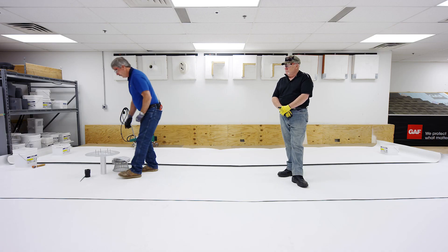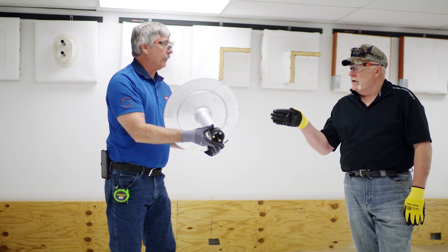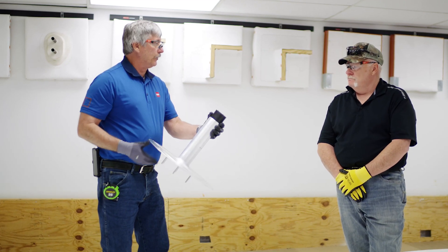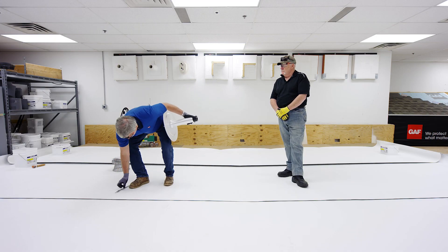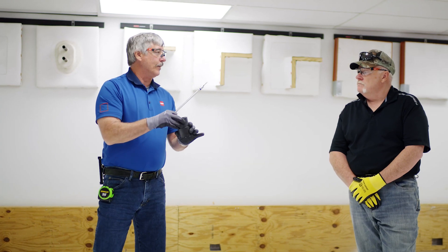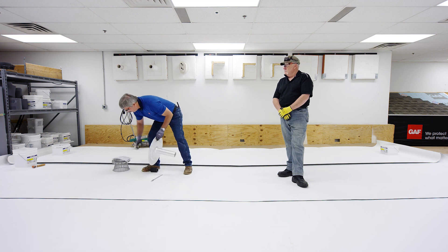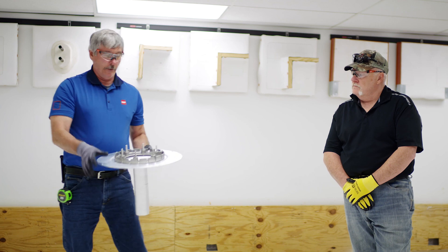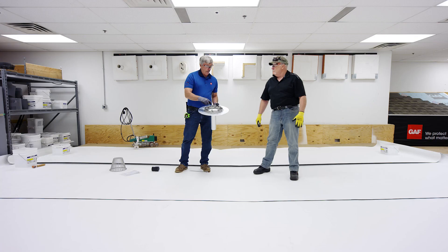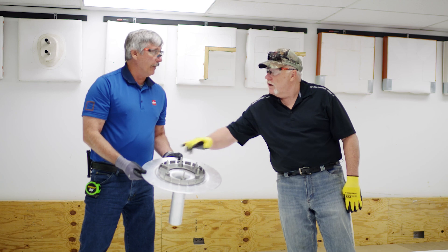Speaking of the drain, there's all kinds of them out there. This one is pretty simple to install and they come in different throat sizes. Basically how this goes — before you install this, you slip it down the drain. There's a rubber piece that seals off; it's going to expand and you need a long extension bit to stick down and tighten these screws up through the throat of the drain, and this expands. That's how it seals off the bottom of the drain. Then your strainer goes on top and then your clamp ring. Once the membrane's installed, the clamp ring goes over top and seals the membrane to the drain. The spec says to leave an inch behind the clamp ring so it can't pull out.